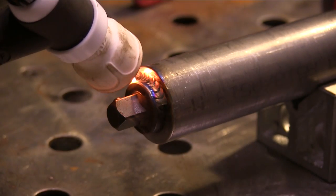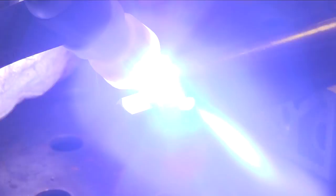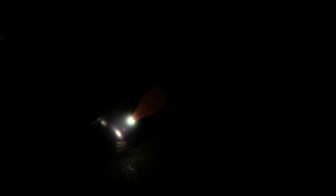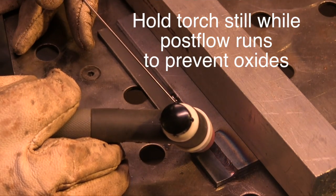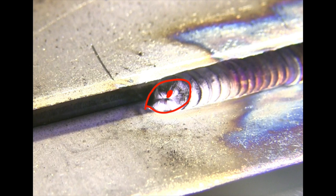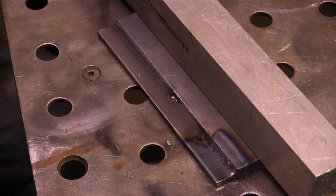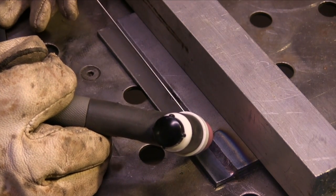Lots and lots of restarts. I can only go about a quarter of a turn. I'm using this ceramic #12 cup — it's doing a really good job shielding, and the main reason I used it here is so I could stick the electrode out pretty far, and it makes it easier to film. Here's a clip from a previous video focusing on restarts — I used a lap joint for this example. I've got a nice tight arc going, punching the puddle all the way down into the root of the joint, but I have to stop for some reason: run out of filler wire, have to sneeze, whatever. I taper off pretty quickly because this is mild steel — I'm not worried about crater cracks. Let the post flow run for a good seven to ten seconds so I have a nice oxide-free crater to restart on, and then I treat that somewhat like a target. I light up and pretty quickly get the arc pointing right dead center of that crater, and within three seconds or less I want to get it to the same size, then move forward and dip and carry on.